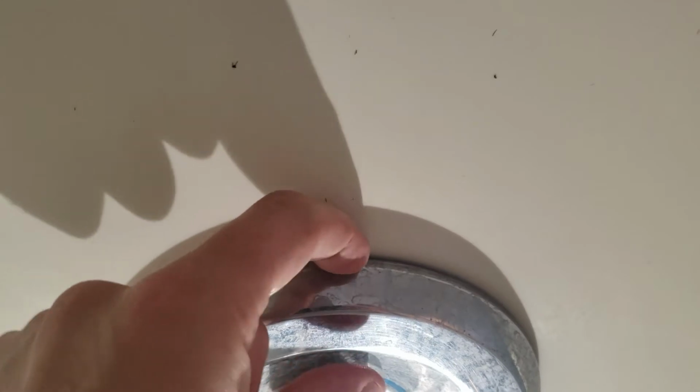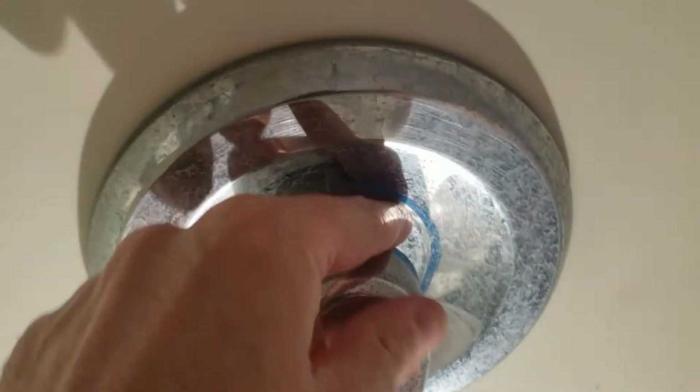So you can see on the outside of the shower here, on the drywall and the baseboard, there's obvious water damage. And it's not as bad as on the other side, but there's a little hole in the drywall there. The other spot that it might be leaking a little bit is right behind here. I can see that the screw's not in all the way, like when I push on this. So I don't know if that might be doing it. Basically I'm gonna remove all of the silicone and redo all of that, as well as this seam here was never done, and the track along the whole side of the shower on both sides was never done. So I'm going to add some silicone in there too.